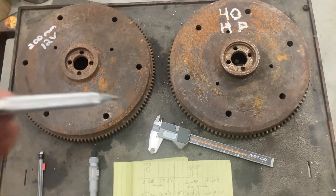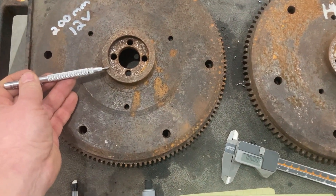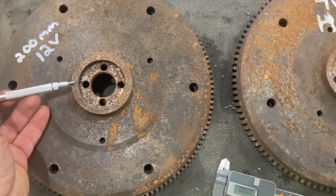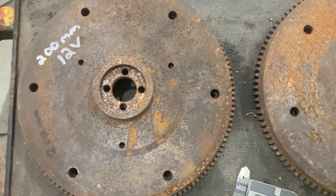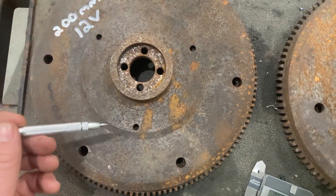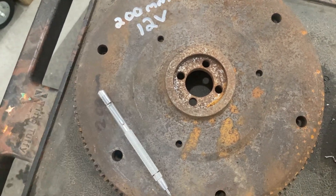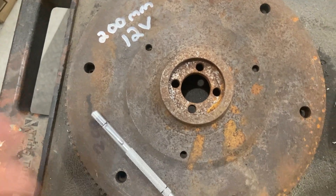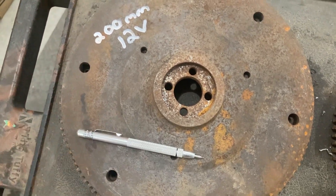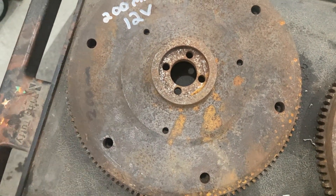What I'm going to do now is throw this in my machine and take off that amount to open it up to 57.25 millimeters, at a depth of 3.75 millimeters, and then it will be able to fit on that crank. For now I'll touch this and clean it up a little bit, just enough to use this crusty old one on my bench engine mount so I can run it and get the thing going good. Before it ever goes in a vehicle it's going to get a much nicer flywheel put on, but for the sake of it, let's just sacrifice this one - we'll open it up and then we'll be able to use it.